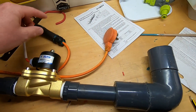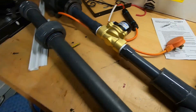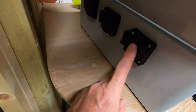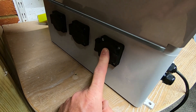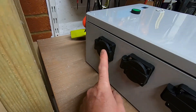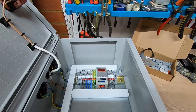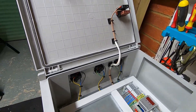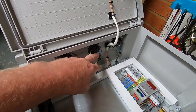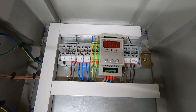The clip I just showed in the greenhouse is what you clip the cable connector to, and then this plug will go in here. So this will be the solenoid valve supply, this will be the air pump supply, and this will be the water pump supply. This is the initiate clean button. Taking me back to my panel wiring years — this is what we've got. The inside of the sockets, all the wiring done, I've just programmed the timer. Now I'm going to fit the waste pipe and fit the box — it's either going to work or it's going to be a disaster.